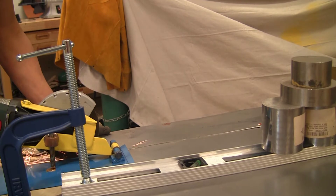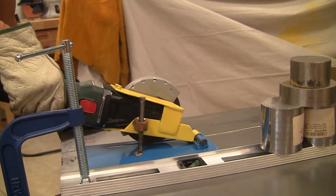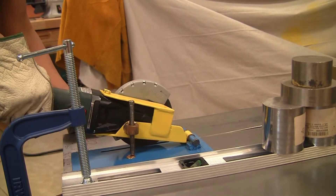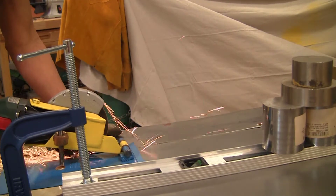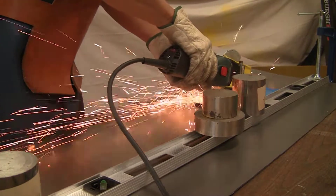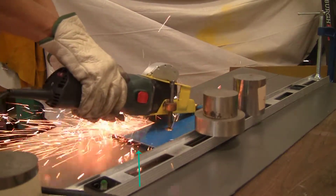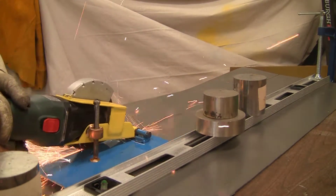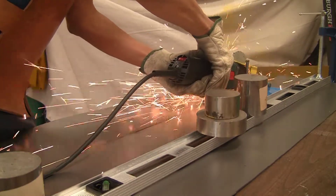So far I've been making these cuts with a pretty shallow depth. This screw on the side of the angle grinder attachment allows me to lower the blade a little bit more, allowing me to cut deeper into the sheet metal, though I'm still being fairly careful with how deeply I'm cutting. After the trouble with alignment, I decided to make a lip on the back of the base as well. Now there's a lip in the front and the back, and this is helping to keep the whole thing aligned with the rip fence so much better.